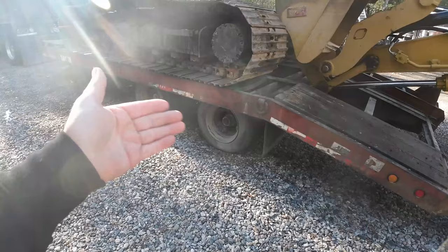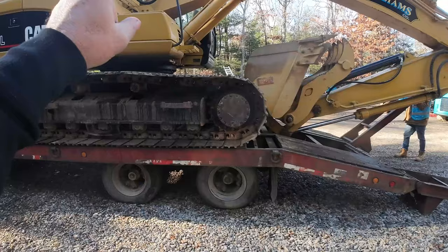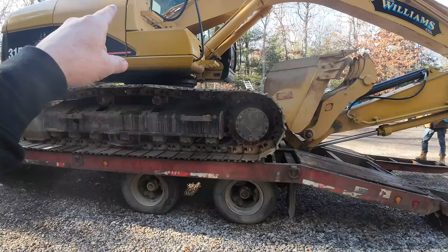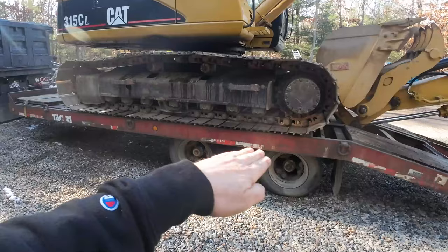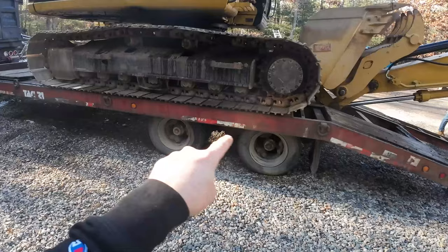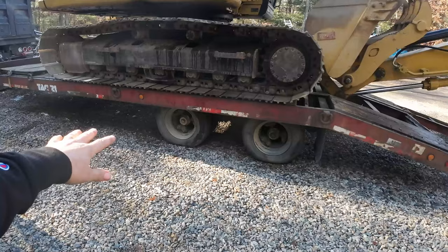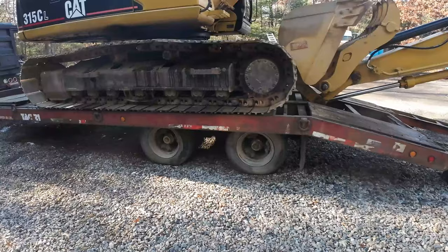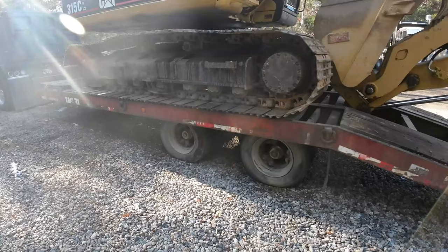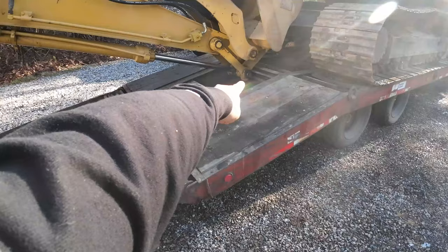You could have a 35-ton low bed that looks the same as a 40-ton low bed. You can have a gooseneck — the towing company that brought this machine when I bought it used a gooseneck tag-along, basically fifth-wheel gooseneck — and that was a 25-ton trailer even though it only had two axles. My friend Nick has a triple-axle that's a little longer but it's a 30-ton trailer. It all goes by axle weight rating. That's been bugging me — people say crazy stuff without doing a little research before they open their mouth.